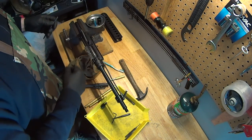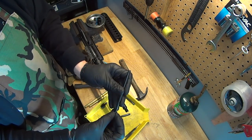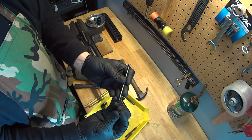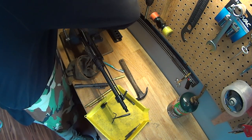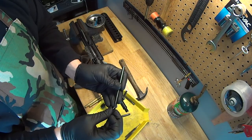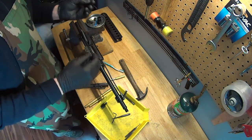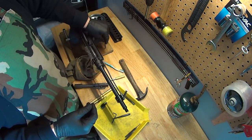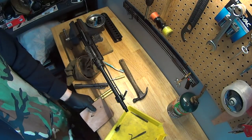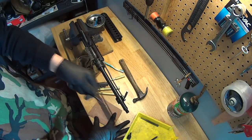Once that's aligned, I then take my slave punch, and I take the pin and I insert it as best I can. And if it doesn't want to insert, actually I don't like that pin. Let's use a different pin. There we go. That one's got a rounded edge. Actually, you know what? I'll show that to you guys. If your pin doesn't have the rounded edge that you're looking for, all right, by whacking it on a wooden surface back here, I have seated this pin inside of the slave punch. I then take 220 grit sandpaper, and I'm doing this motion while dragging.